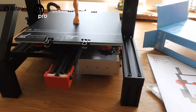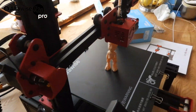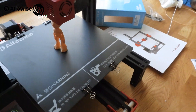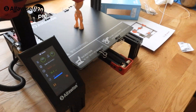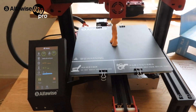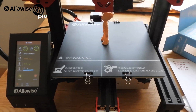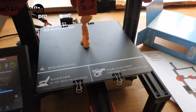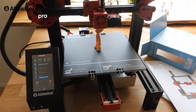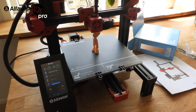It's nothing to compare with the Ender 3 — it's absolutely a different machine. This printer has all the sensors: a filament sensor (some kind of laser sensor I think), a power failure sensor, and a big touch screen. It's very quiet. You can also remove the drivers and change to your own, but I don't think you need to because it's really, really quiet. And it's open source — Marlin firmware — so you can use your own settings and tune the printer your own way.